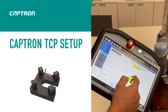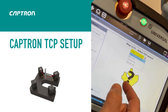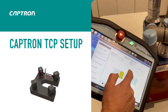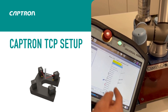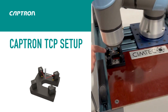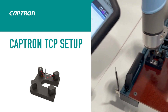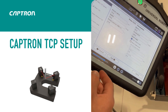Here you will see the wizard — it's a seven-step guidance. You choose the right variant; in this case we have the 70T. Next, select the inputs — we had digital 0 and digital 1 for X and Y. Then choose your reference TCP which you've configured. Then set the center — this one is already centered as you can see on the LEDs which are on. Press next; there are predefined values, so you can press next again if you don't want to change anything.